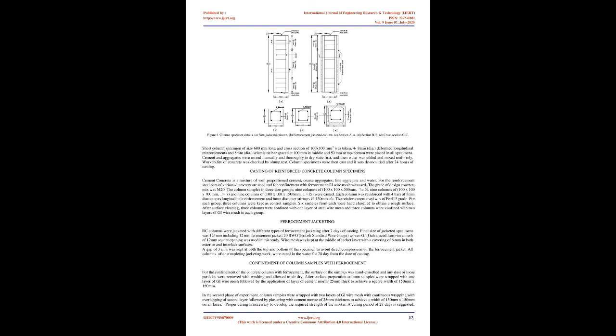Materials. Steel skeleton: this is used for making the framework of the structural component upon which layers of wire mesh reinforcement are laid. Wire mesh. Cement mortar. Cement, OPC or PPC of grade 53 is used. Sand: well-graded natural river sand with particle size less than 4.75 mm, having fineness modulus between 2.5 and 3.0. Cement sand mix 1:1.5 to 1:3. Water cement ratio 0.35 to 0.55. 5% of plasticizers and other admixtures are used.